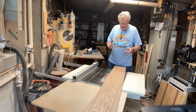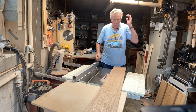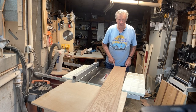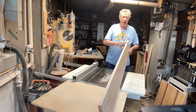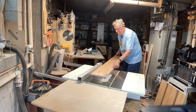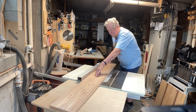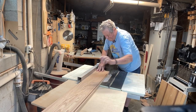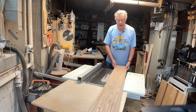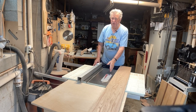First of all, I take the narrowest part of the length of the board — this one is seven and seven-eighths inches. Down at the other end it's a little over eight inches. So I'm going to set my fence at a little less than that dimension, then run the straight line from the lumber yard against my fence. After I've made that cut, I'll turn the board end for end and move it over about a sixteenth of an inch — that's about half the width of this eighth-inch blade.